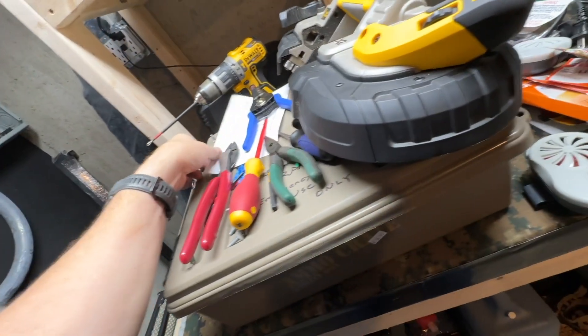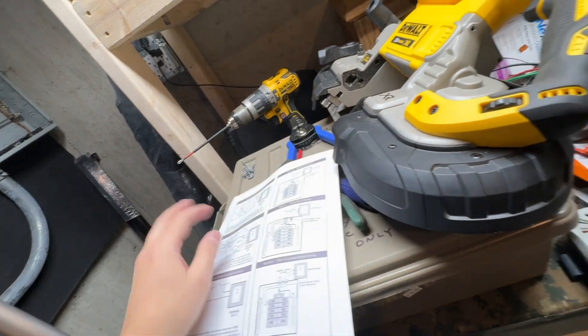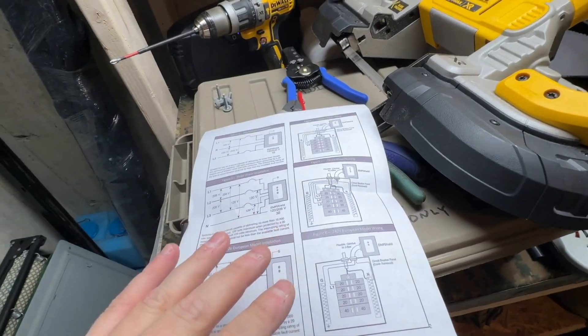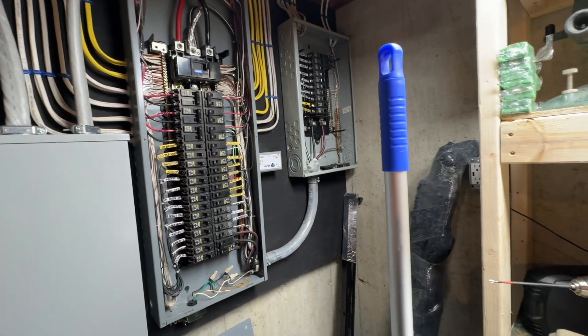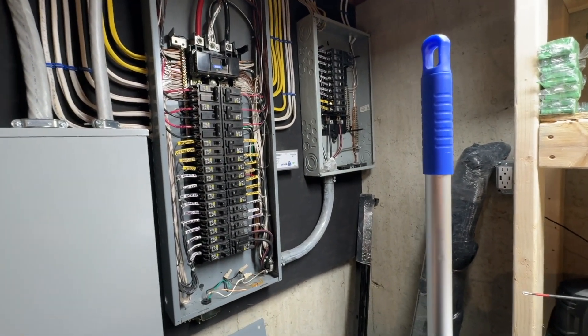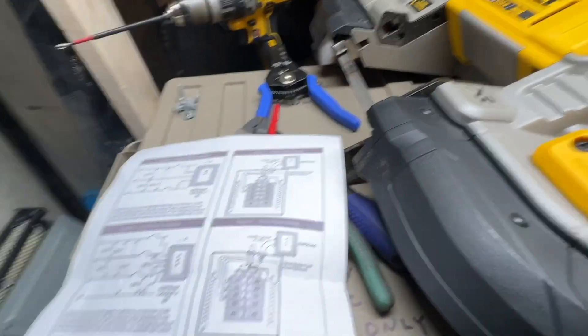As the pulse is building, before the wave is even complete, the device shunts the energy to ground and that keeps your circuitry and appliances from getting burned up. If you're not comfortable working in a breaker box, you should not do this yourself — have a licensed professional do it. I'm comfortable working in these so I went ahead and did it myself. It's four connections.